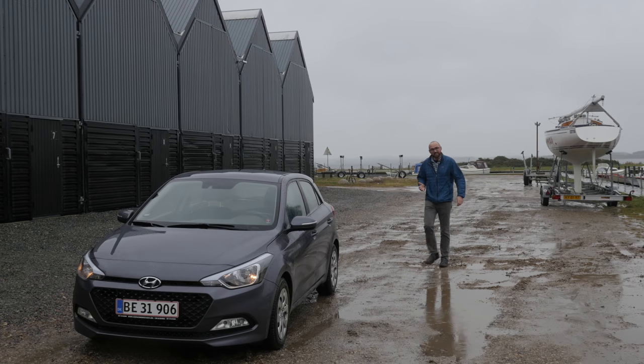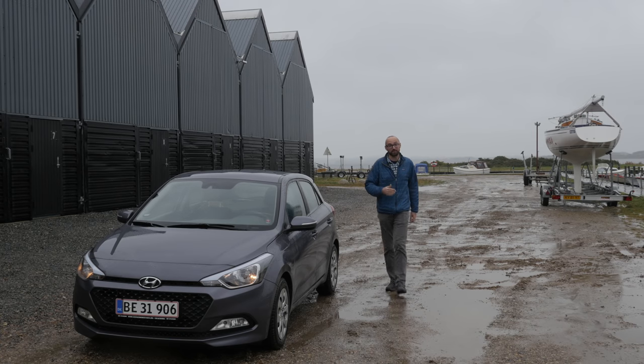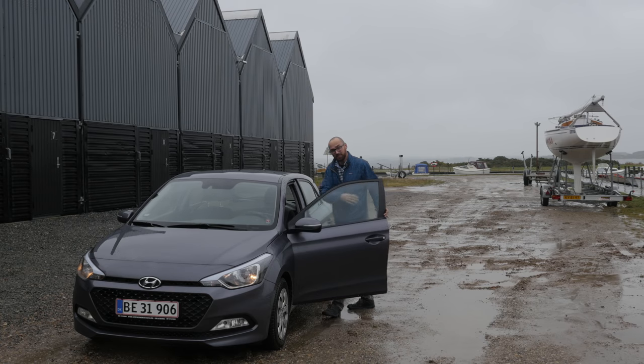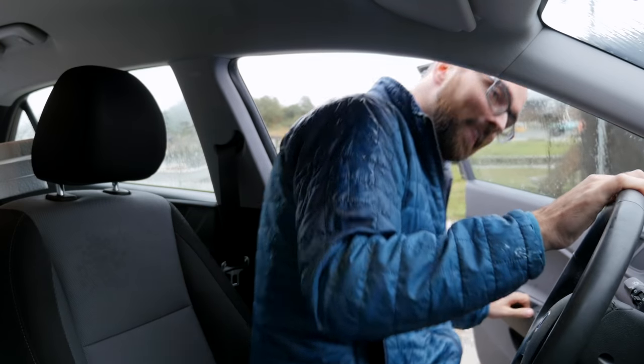During the summer I've also gotten 93% of the hull dried out with the help of my DIY hot bag type setup as part of an osmosis treatment. That means I can get an early start next summer on fairing the hull and getting it all sealed up before applying copper coat. All in all a pretty spiffy summer if I do say so myself. But sadly winter is just around the corner, and that means I only have maybe a few more weeks where it's warm enough to work on the exterior of the boat.